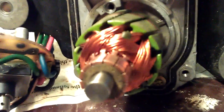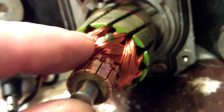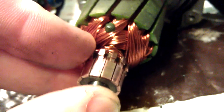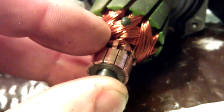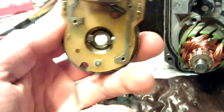The motor I had to clean up quite well, because there used to be two deep grooves in the surface contacts where the brushes used to spin. I had to make them nice and smooth so there's no possibility of a brush not making good contact. That's done.